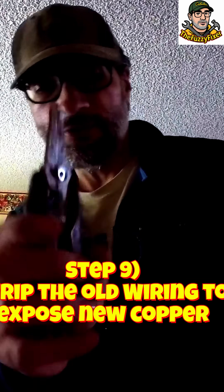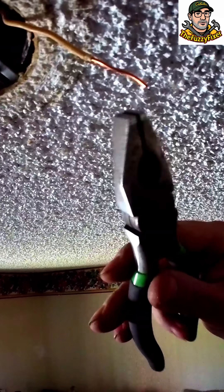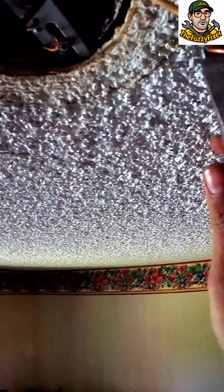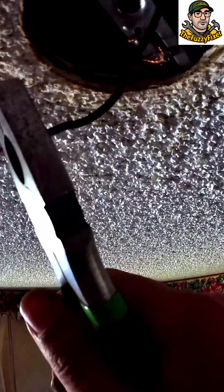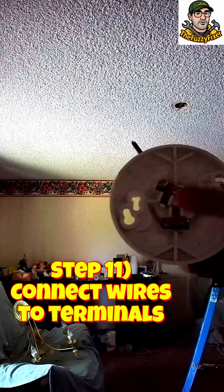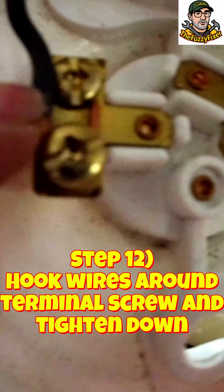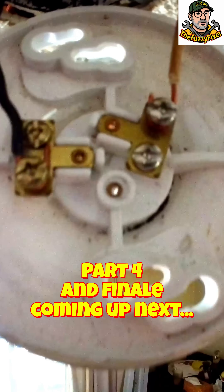With your wire strippers, strip off about that much copper wire — open and bare. Make a big little hook loop, hook it around, and tighten this down. Then screw this back up, put your bulb in, and straighten out your wire as best you can. Make a loop — it goes around your nut and you just tighten your nut down to it. On the other wire, denoted by a darker color on the positive side, hook it around the thread of the screw, give the loop a little tighten for more contact, and tighten it down. Repeat on the other side.